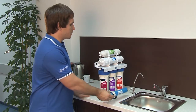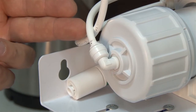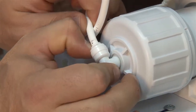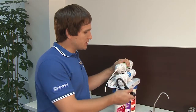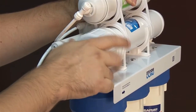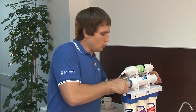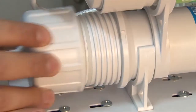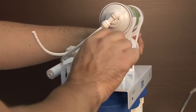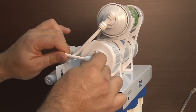Push the black plastic tube into the fitting of the saddle. We now need to install the RO membrane module into the body of the filter. Push out the plastic tube from the fitting in the cap. Remove the cap using a supplied wrench. Push the membrane all the way into the housing. Put the cap back on and push the tube into the fitting just as it was initially — that is about 17 mm deep.